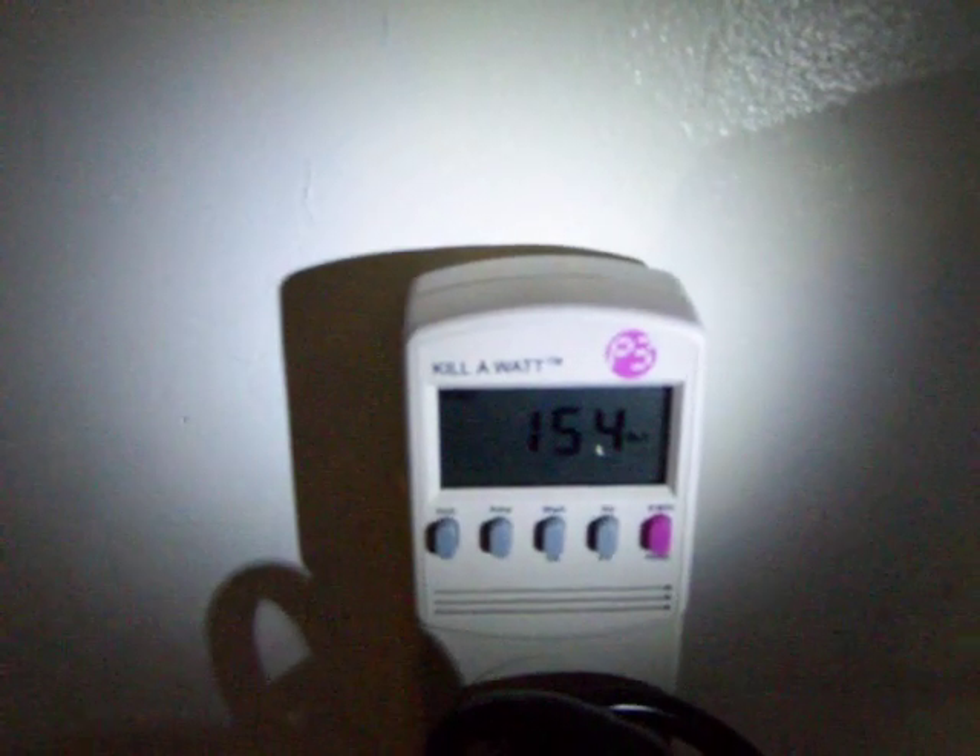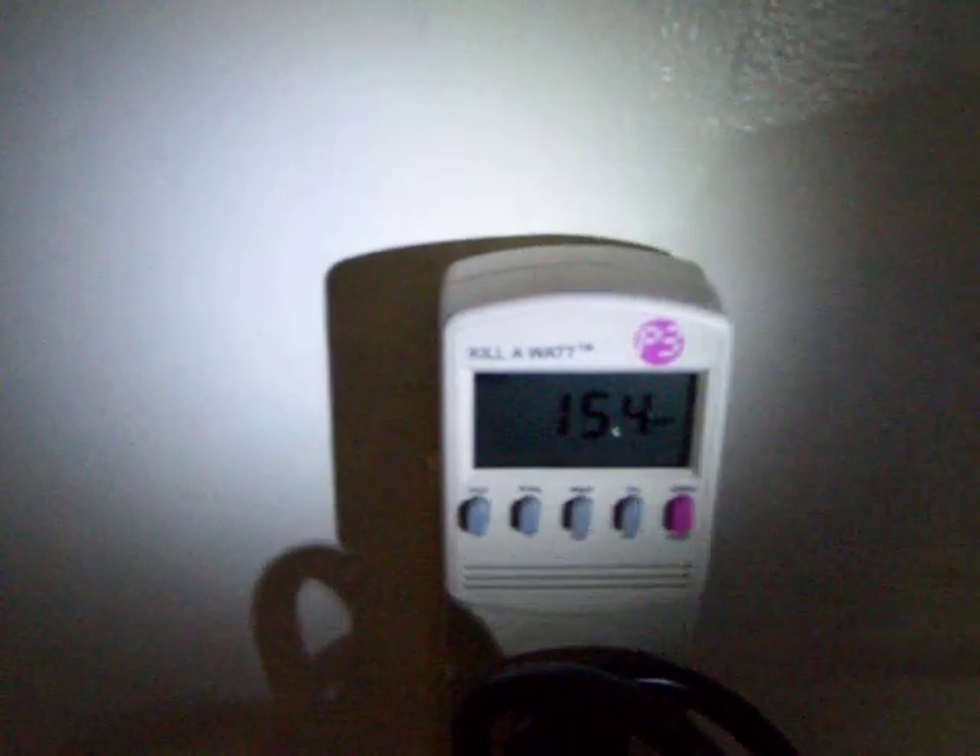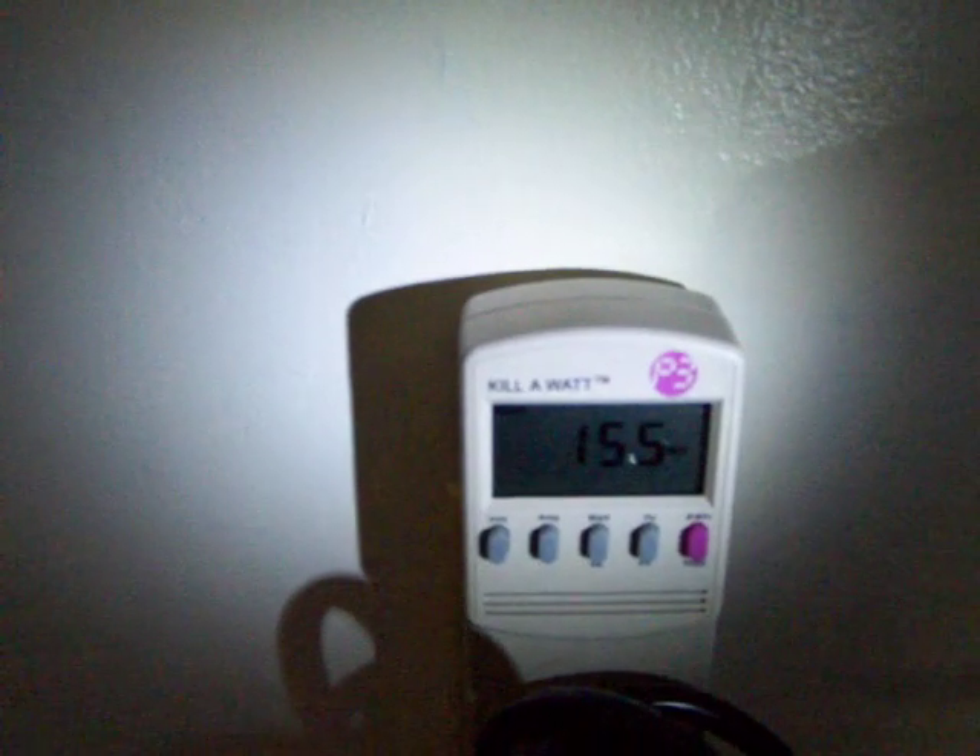154 watts — like I said that's not that great but it was up quite a bit higher earlier. A little while ago I had 5 amps coming in from the wind. This meter here is my wind amps. Seems like any time I ever get this camera near this gauge I've got no wind coming in. I would have liked to see 5-6 amps coming in out of that.